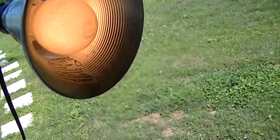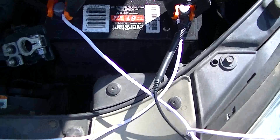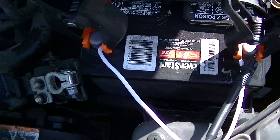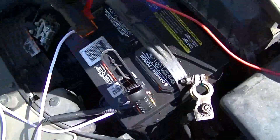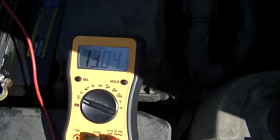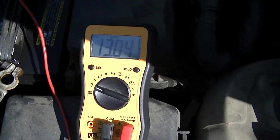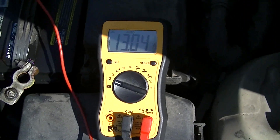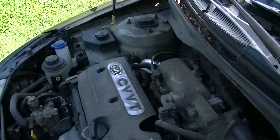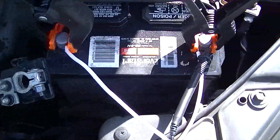Here's what our bulb looks like — it's a 100-watt bulb, but it only has the half-wave going into it, so instead of a normal 100 watts you're getting about 50 watts out of it, minus what we have going into the battery. So we have actually a bit less than 50 watts. The voltage drop across here is 13, so 120 divided by 2 minus 13 — that's 60 minus 13 — is 47. So we've got about 47 volts across the light bulb.